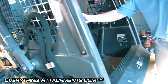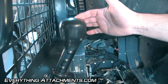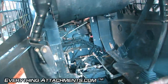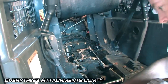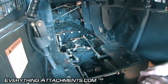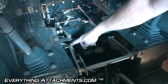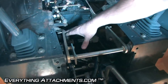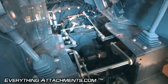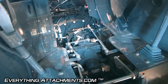We're using the switch that's already located on here — your multi-function switch. It's got an up and down picture of a cylinder, and that decides which way it goes. This is the main pump on your skid steer — it's going to be the same whether it's the Bobcat, New Holland, whatever. You want to find your main pump and where your pressure comes from the pump and goes to your control valve. We've removed that line and taken the pressure, and we've gone straight towards the electric hydraulic valve. The one thing you have to remember is there is no relief valve in that hydraulic valve. If you were to bottom out a cylinder and you did not put a relief valve in the line, then you're going to bust a pump or you're going to bust a valve, maybe a line if you're lucky.